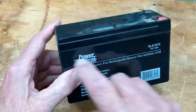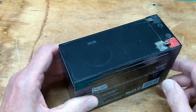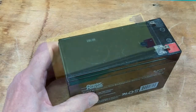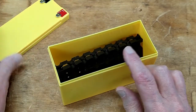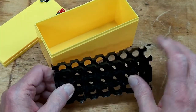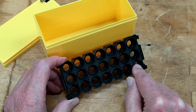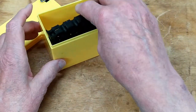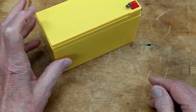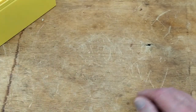You can take one of these lead acid batteries and cut it apart and pull all the guts out — there are videos on YouTube showing you how to do it, but it's kind of messy dealing with acid. Really not worth it. Go on eBay and look around. You'll find these do-it-yourself 12-volt battery kits that come with holders or spacers designed for 18650 batteries. It puts seven in parallel, three in series. I paid $7.60 each shipped out of China, and I got two different colors so I can keep track of the two different battery packs I'm going to build.